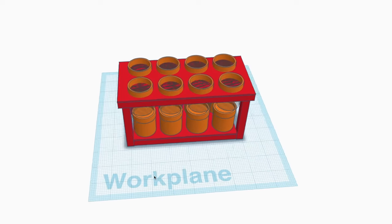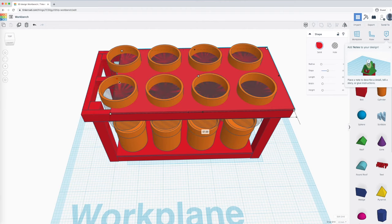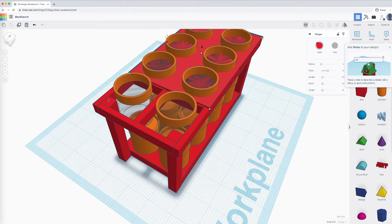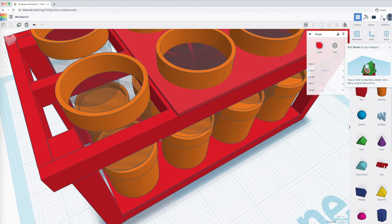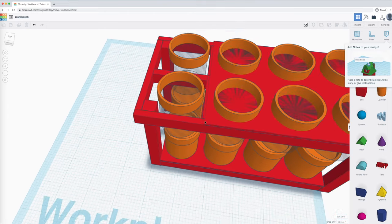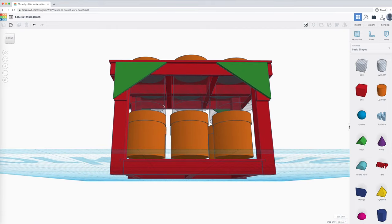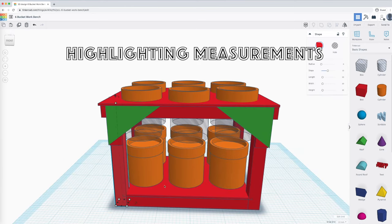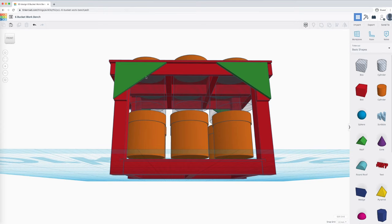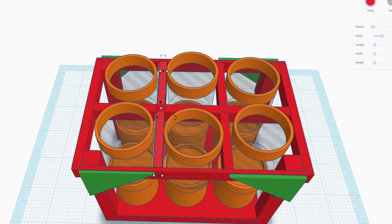I started with a table that fit eight buckets. As I got further along in the design, I realized that if buckets are full of glaze, they're at least 50 pounds. If I have eight buckets above and eight buckets below, that could be upwards of 800 pounds of just glaze plus the weight of the wood. Casters that can support a thousand pounds become very specialized and expensive. I also started questioning if my construction was safe enough for students to use. So right after finishing my eight bucket design, I shrunk the design down to six buckets. In doing so, I realized I could squeeze this table into a 48-inch dimension. Plywood comes in four by eight foot sheets, and this allowed me to save money on plywood because I was able to get the top and the bottom piece out of one four by eight sheet. With the top piece being limited to 48 by 32 and a half, it made a tight squeeze for all six buckets to fit while being supported by cross beams of wood below.